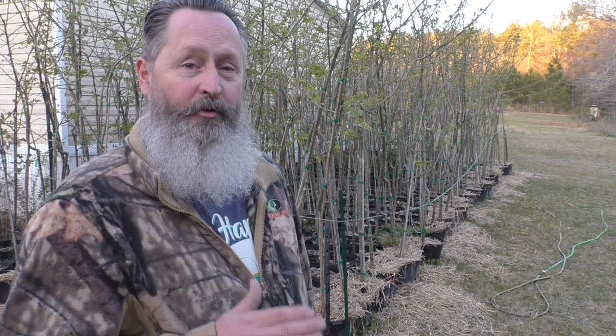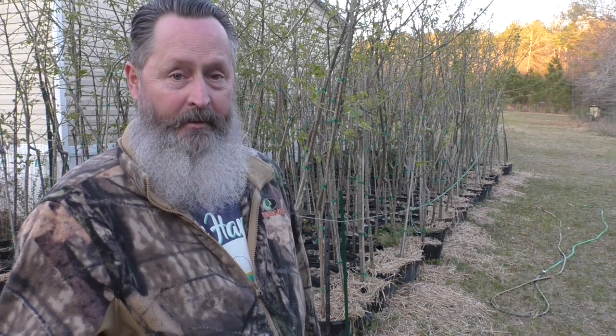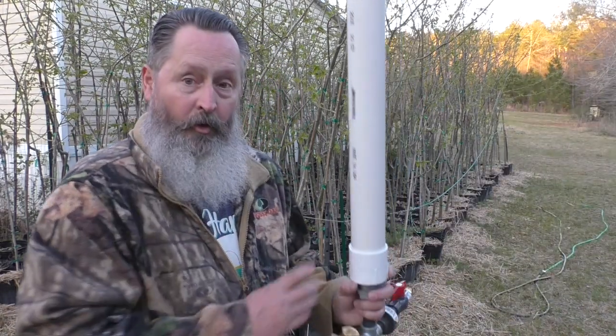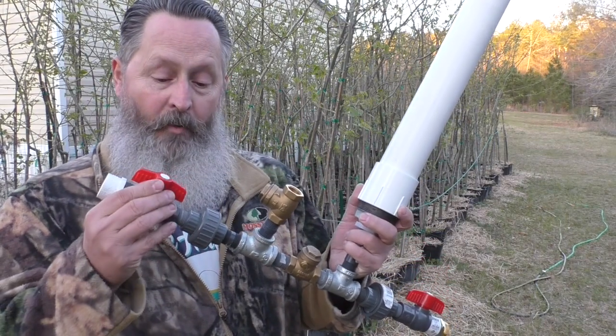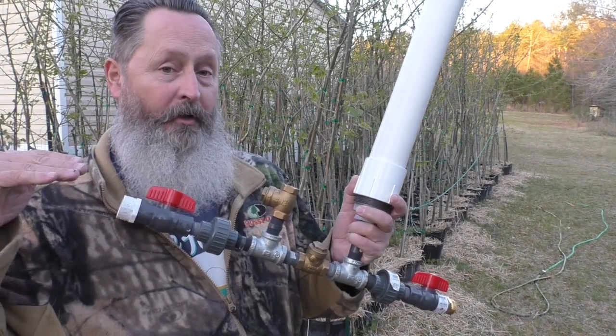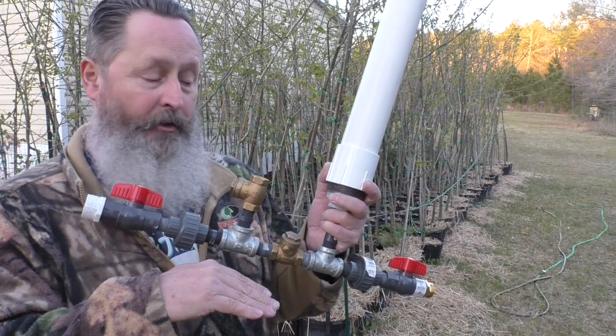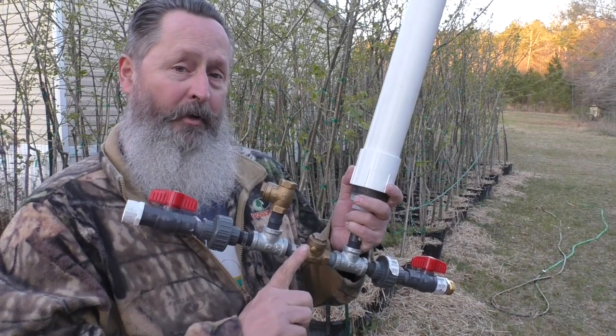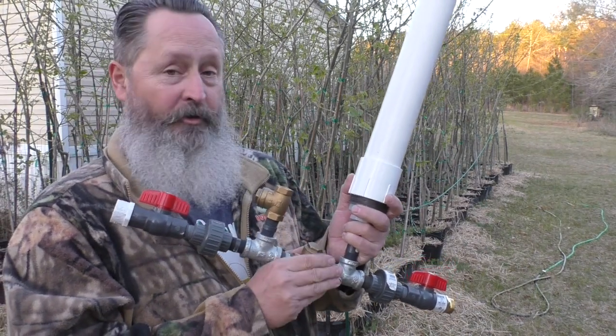So, in steps YouTube, and in my video feed was the answer to what I needed. And that's where I think YouTube shines, is the things that we can learn from there, the things we can teach each other, and the experiences that we can share. Because I saw a video pop up in my news feed for a hydraulic ram pump where you can pump water without the use of electricity, just based on the energy of the water as it travels down a slope. And for every foot of elevation that it loses, it can pump water 10 feet in elevation gain.